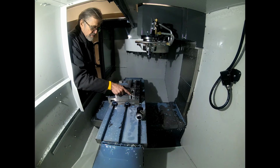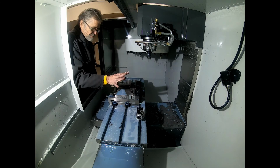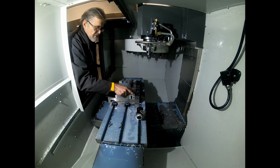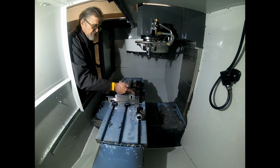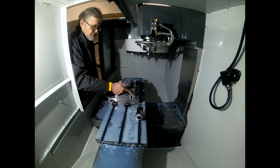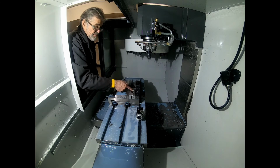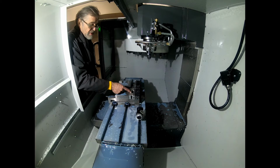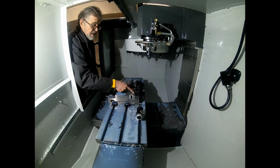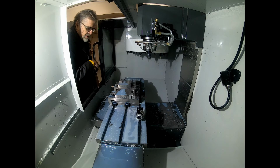So what I think I'm going to do is go into the CAD room and figure out what my measured distance of the vise jaws is, and then subtract the nominal size of this part, the size that I was trying to hit, and then set that as the 0 for the next work offset. I usually cut my parts long, which means the error will be in this direction, with a little too much material hanging off, which is just fine. So by doing it with the nominal dimension, it's logically equivalent to having the stop set on that side. Actually, it's not exactly equivalent, but it's functionally equivalent. So I'm going to go in the CAD room and think about this for a couple of minutes.